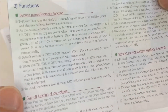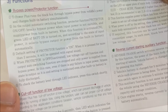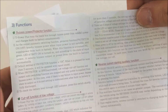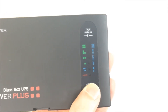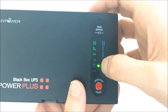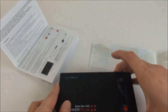The original manual said the default setting of the protector function is on, and when pressed for more than two seconds it will operate with a signal sound, and when it's off, low voltage cutoff functions are stopped and only power is supplied from bypass power. The main reason I was confused is that from my knowledge the protector mode is actually off by default — you have to turn it on and you know it's on when the second light turns on. The manual calls it the first light, which is another thing that confused me because it's technically the second light. But this new one makes the instructions much more clear.